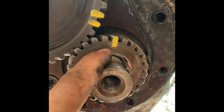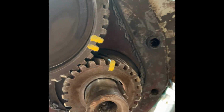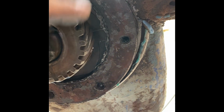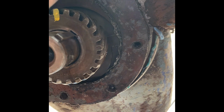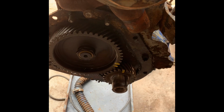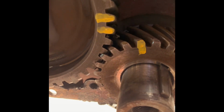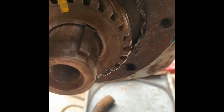I was told by a really old friend or an old welder tech that this timing mark was for other applications and whenever they ran the engine in reverse. Apparently they put it on a bunch of water pumps, natural gas compressors, a bunch of stuff. And depending on the specs of the equipment it was put on, you would time it to that dot or that dot. All the welders, it's that dot. Don't worry about that little guy.